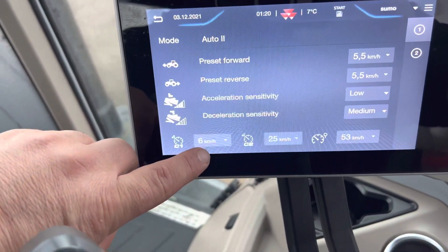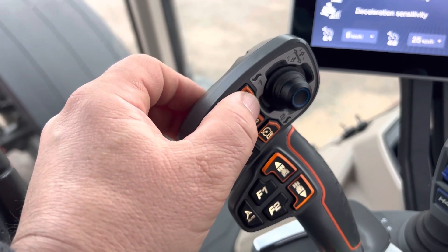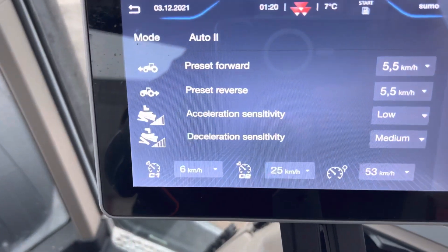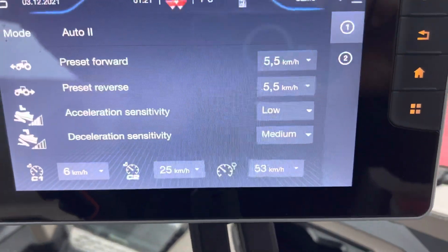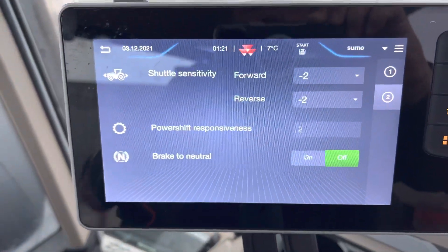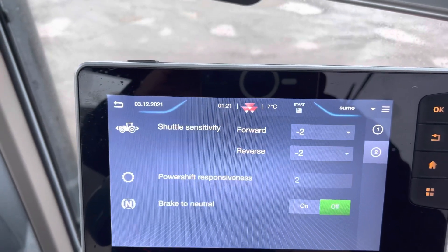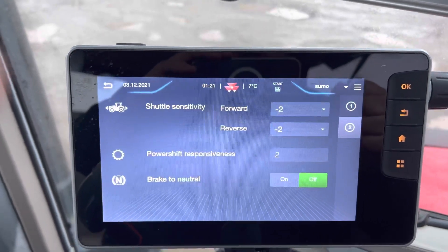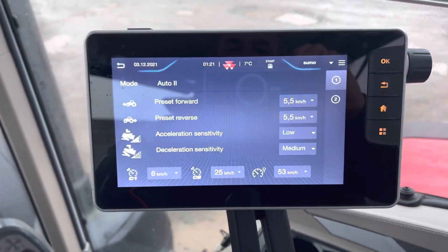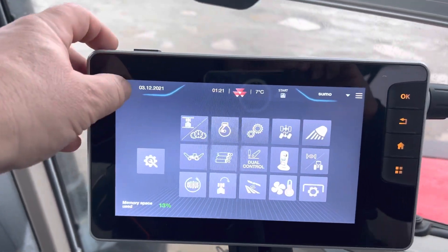You can also set your cruise control speeds through the screen here if you want — dead easy to do. If you've got it set and the green light's on on the joystick, you can roll through that on your roller and it will change it on there, but to set your cruise control speeds it is easier to do it in the screen. On this page as well, if you press against the number two it brings up your shuttle forward and reverse sensitivity and how quickly the tractor changes its gears — the power shift response. If you want to, you can have it clicking through the gears in a nice, firm, positive way. Don't forget those settings in there for this transmission, because it's those little bits that really do make the transmission side of the tractor sing.